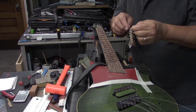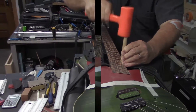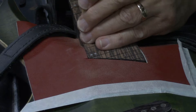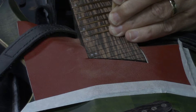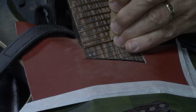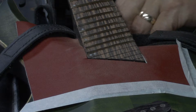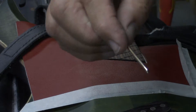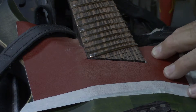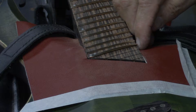I've got all these frets in order — I pluck them off one at a time and in they go. For these last few frets, because we've got that tapered end, I want to get this side of the fret flush so I don't have to touch it — that outside side is easy enough to dress but this side is very difficult to get to. I want to bring this side right up flush and then any extra length will come off that side.